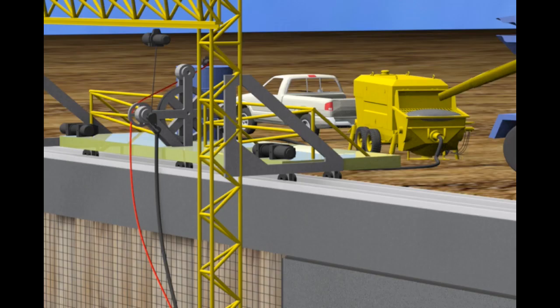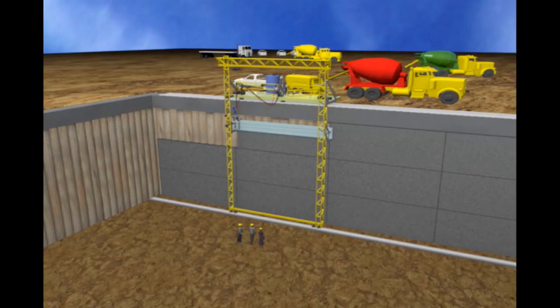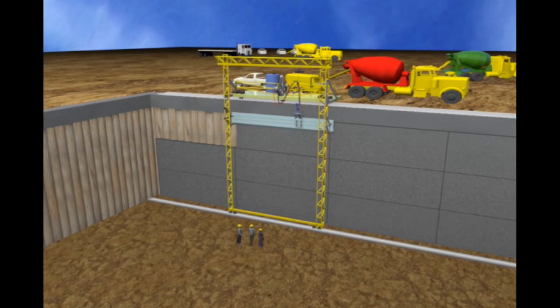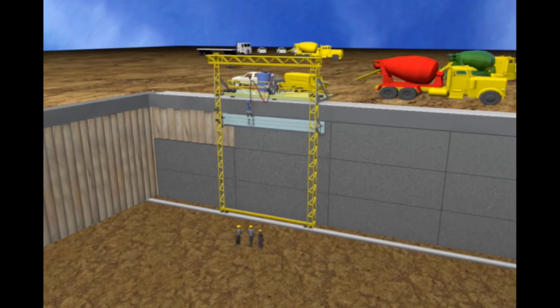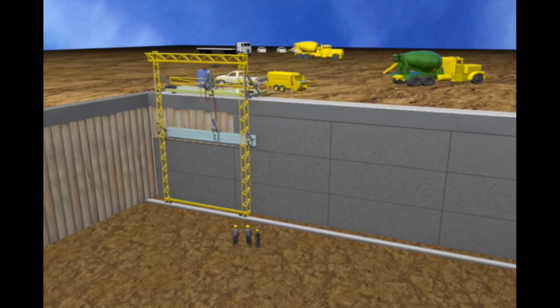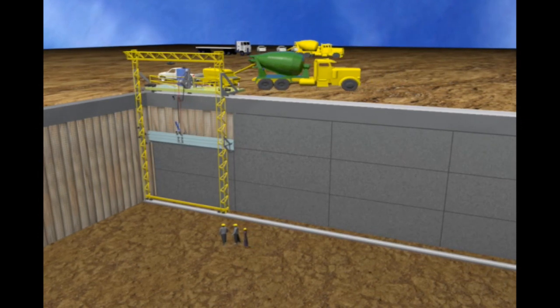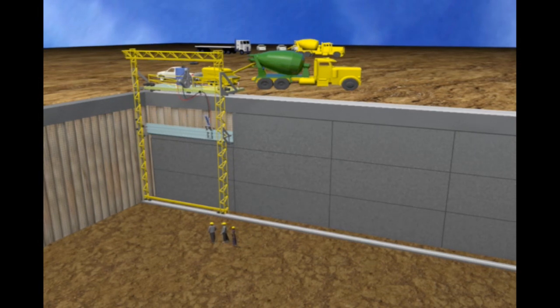The control platform handles the concrete hose, the admixture dose, the slip screed height, and the carriage travel. After the slip screed closes out one bay, the system shifts to the next. The end bay can be custom — the slip screed just overlaps the placed concrete. It has pressure sensors to confirm concrete consolidation before advancement of the nozzle can continue, and of course there are cameras.